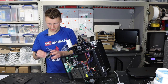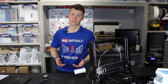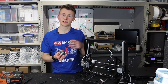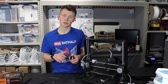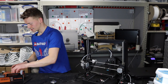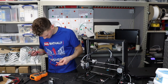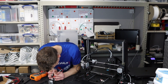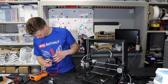You can then take the stepper out. Anycubic sent a good video of how to identify whether the stepper is working or not, but obviously it only works if you've actually got a multimeter. If you haven't got a multimeter you could swap the connector into another axis and try to turn it to see if it works. Since I do have a multimeter I'll test it their way — testing pins one and three to see if it beeps, then four and six.